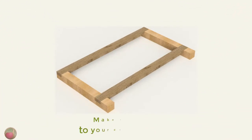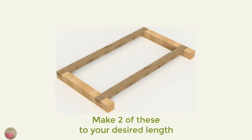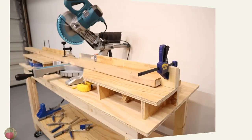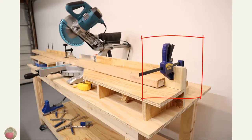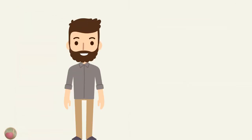You'll actually mount the plywood squares and casters later, and I'll show you how I did it. Okay, let's get to the frame supports, because this is the easiest part of the whole build. You're going to make two of these. To ensure all four aprons were exactly the same length, I used a stop block on my miter saw station — that way I could measure once and cut many.